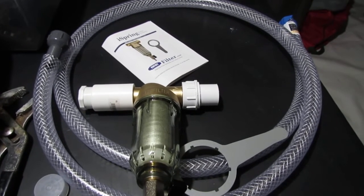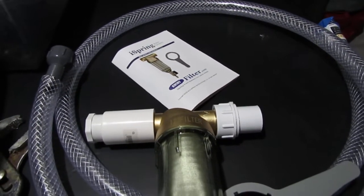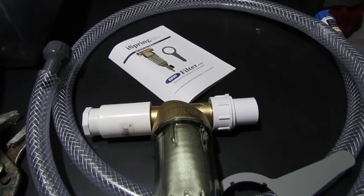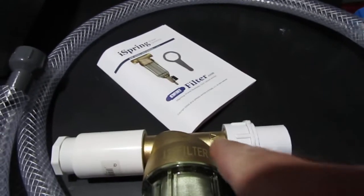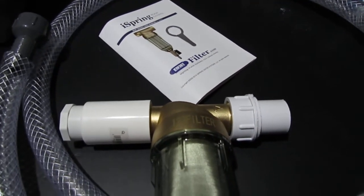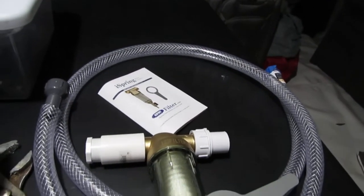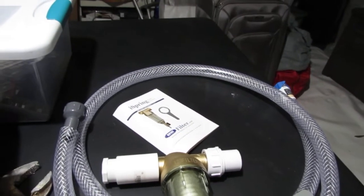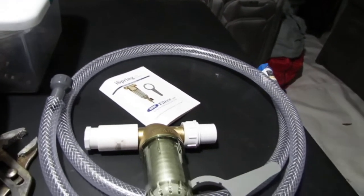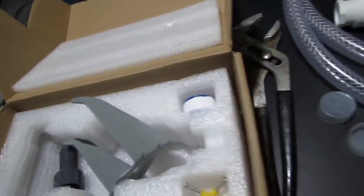When you put this in, it's a good idea to put a ball valve on the other side so you can service this filter, and you should also have a secondary cutoff valve for safety. You can see the arrow on here, so you have to follow the water flow direction when you install it. You're probably going to want to do this on a day when no one's home, because you may have the water off for quite some time depending on what problems you run into. It did come with a mounting bracket and Teflon tape.